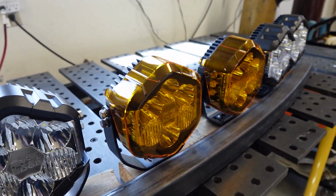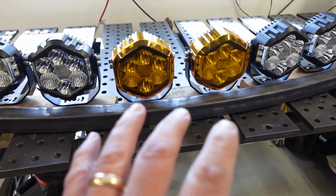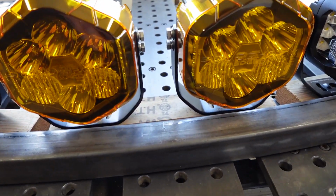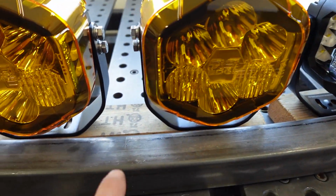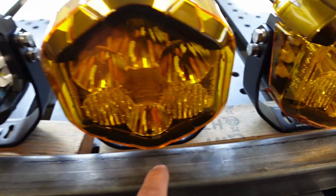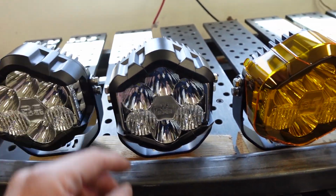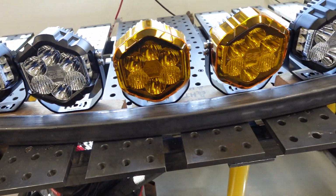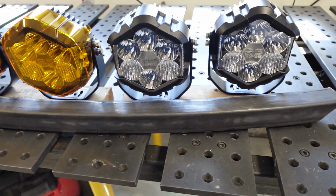But what we're going to look at here is where we want the tubes to land on this square tube such that they don't interfere with the brackets that I'm going to make to hold these lights on there. I'm going to make the tubes basically land in the center over here and then in between these two end lights over here. So that's how it's going to triangulate in. And I'll be using 1.5 inch DOM tube for that, which will be cutting on the Dragon A250.